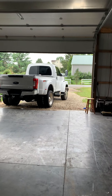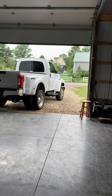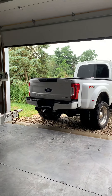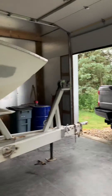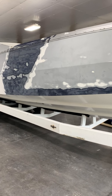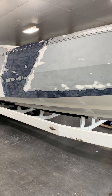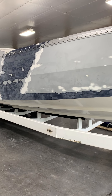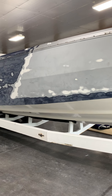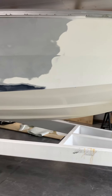I think this boat should be well into the mid-90s. It ran 80 with the full cabin and everything on 575s a side, so at 875 to 900 horsepower I'm thinking mid-90s. We shed weight from that cabin — I weighed everything when I took it out: 1,548 pounds of cabin and wiring. We'll probably put back about 500, so we shed a good thousand pounds. I also shortened the fuel tanks a little bit, so this thing should rock and roll. I'm excited to get it on the water, hopefully in the springtime.